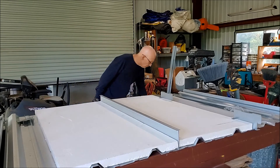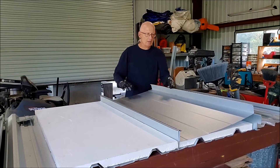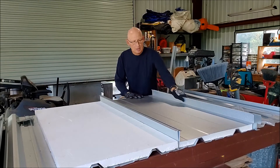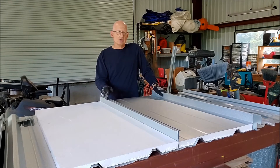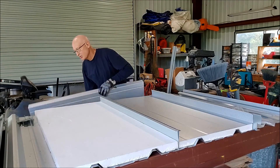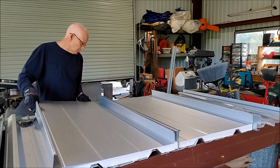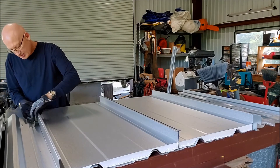The insulation goes down first, then you take the panel and set it on top of the insulation. Here's a 24-inch wide symmetrical standing seam panel — the clips over here have already been installed. You can just snap the panels down into the clips, which makes it really nice. One of the great things about this system is that you can pre-install the clips. You can get the roof down like two or three times faster if you've got one crew putting down clips and another crew putting panels in — you can see how easy the panels snap into place. The next panel locks into this clip, and then here we just use an individual clip that locks into the panel.